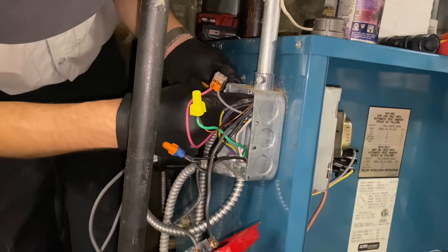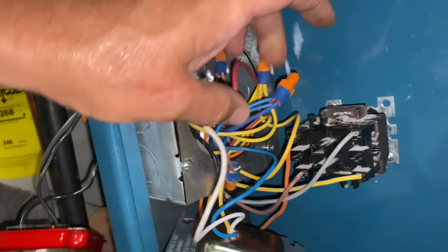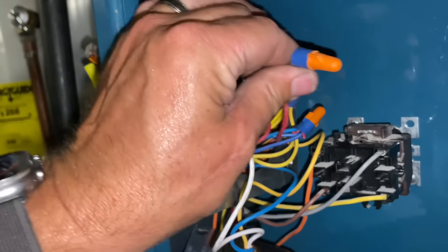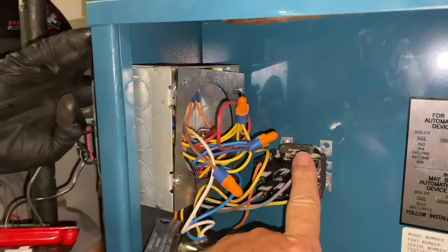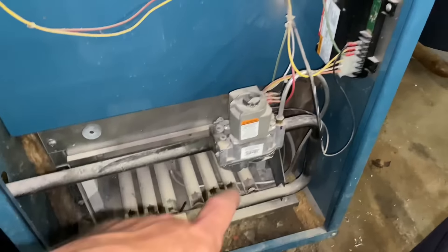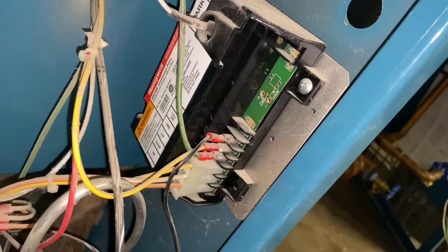We removed a Phillips screw from the transformer chassis. We had a couple of wires going to blue, which is common, and brown, which goes to our thermostat relay. When we reconnect that relay it's going to go to brown and blue, and that's going to turn on our thermostat relay, power our automatic vent damper, and all the other safeties — before it sends 24 volts to the electronic ignition gas valve module and then to the gas valve. Let's call it the intermittent spark ignition module — the right terminology.